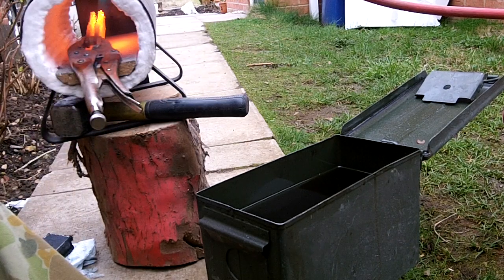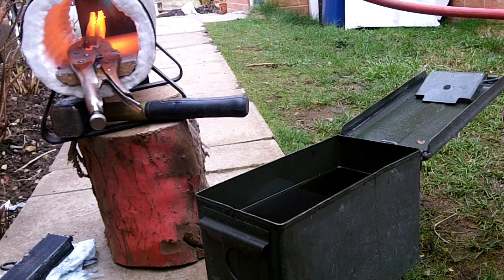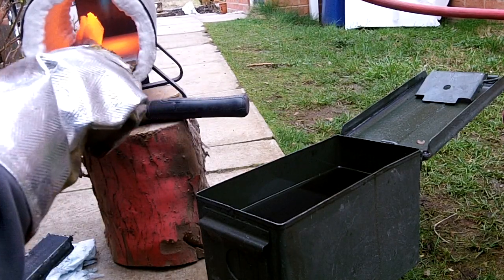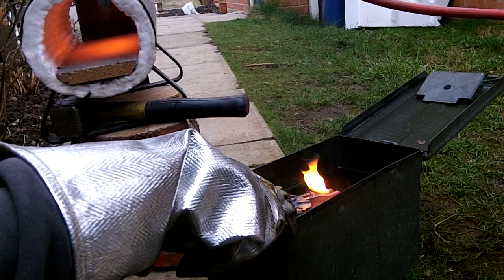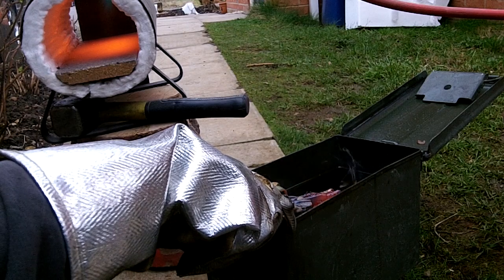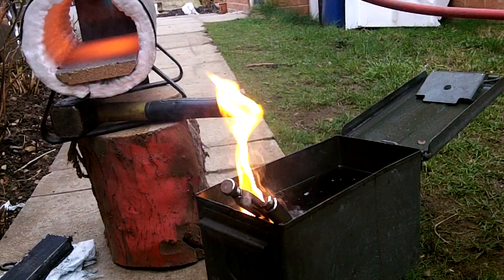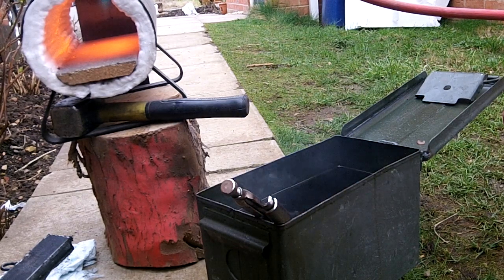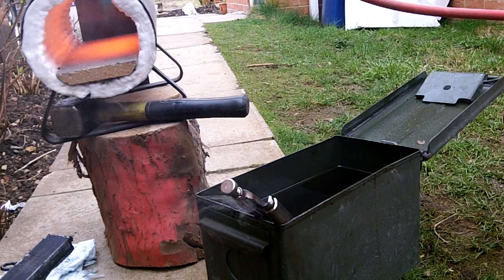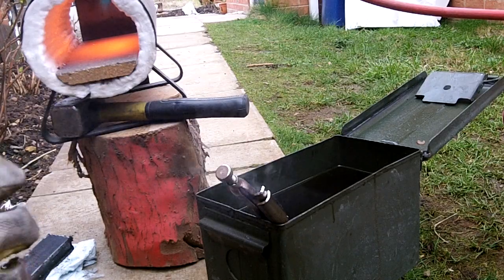That's a critical. Just put it back in, get it back up to the same. Most of the time now I don't really check with a magnet, but with it being a foreign steel, it's not gonna do me any harm to be extra cautious. Once again, edge quench. The oil's now heating up, so when we do this for the third time the oil should be closer to the target temperature, which I'm supposed to be aiming for. Am I having fun? I don't need to answer that. I need some new gloves, though.